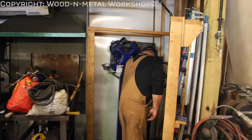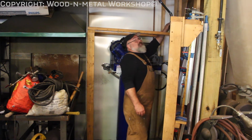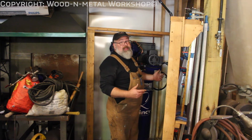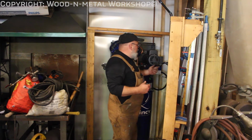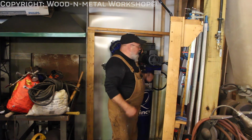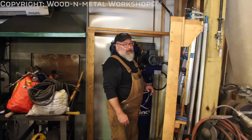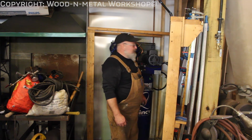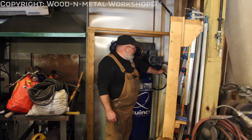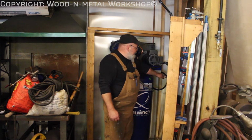At 175 psi, you're gonna hear hissing. And the other thing we need to do is blow any swarf that's still in the pipes out before we start putting our final fittings on. So, you know, from threading, you get little chips in there sometimes. Did my best to clear them out, but you never know. So, we'll crack this drain valve here and let it take anything out of this section.